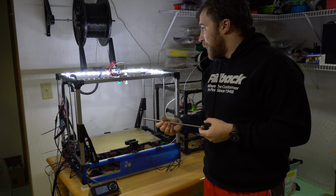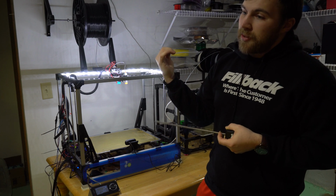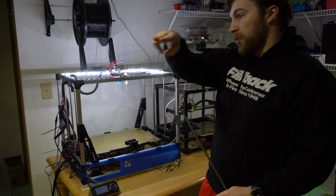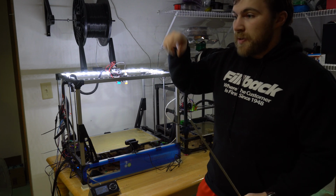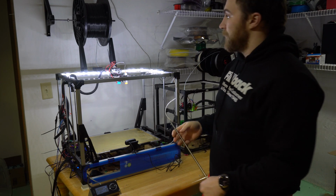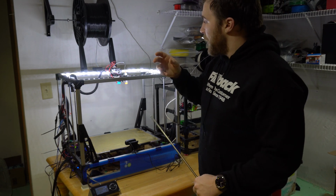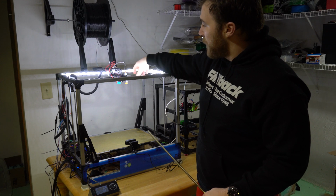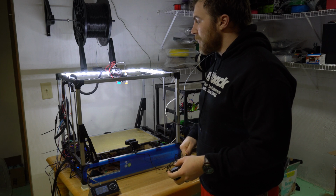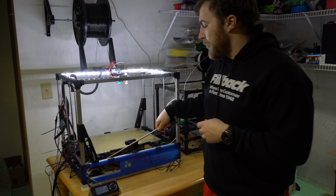But from a stiffness standpoint, it's far better to have them vertical so that both the forces down are fighting against each other. It's similar to an I-beam. When you want to support stuff across the span, the I-beam should always be vertical with the I in normal mode. So it's the same type of problem, because when you have twisting on there, it goes against both bars instead of not. But I plan on reusing the X, the Z, and then the Y bars as well.